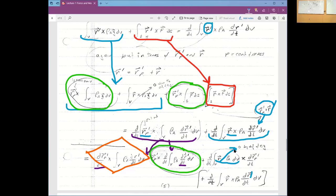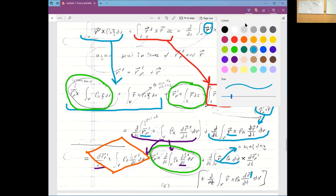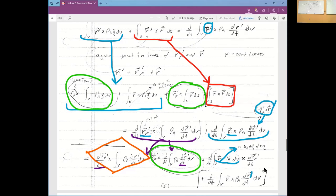And again, it really is that. Although it's a distributed mass, we have the same amount of mass on the right of the CG as we do on the left of the CG, and so that term just cancels out. And then I want you to draw another box, about this term.